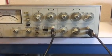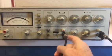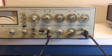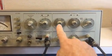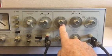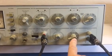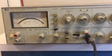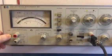The output of that — say, like an amplifier — would come back into the input of the distortion meter. But today we're just looking at the oscillator itself. I have the oscillator set to 1kHz and the level set to one volt. Let's go ahead and turn on the unit.